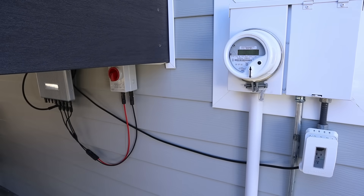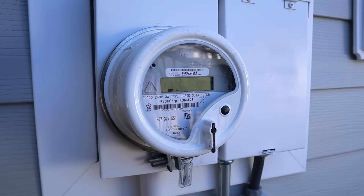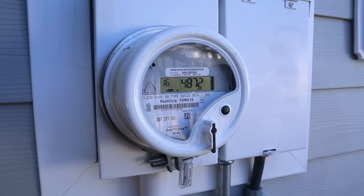What I love about this setup is that it uses the EcoFlow smart app, so you can access the system remotely anytime you want to see what's going on. Right now I'm back-feeding about 430 watts into the grid, offsetting loads in my house. If we look at the screen of my smart meter, you can see that we are showing zero power being used by my house — and that's the whole purpose of this setup: to offset your power usage.